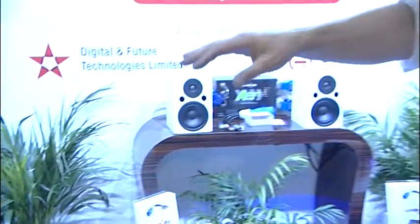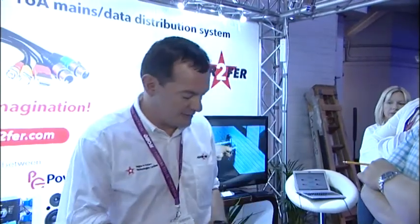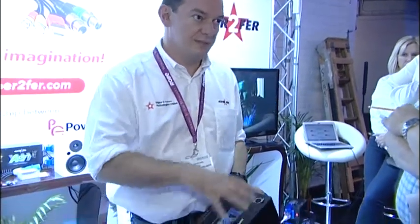We've also got a built-in IP-enabled ammeter in there, so we can actually see how much power the stand is drawing anywhere across our network. Anywhere we put one of these boxes, we basically have an Ethernet port on every box. So we're naturally building an Ethernet network as such. It's a power line network that we're basically bringing to the entertainment industry using these boxes.